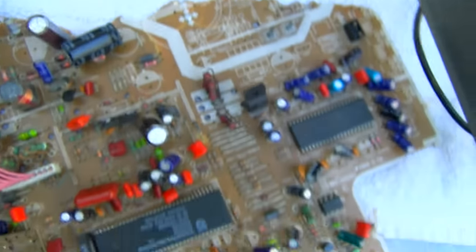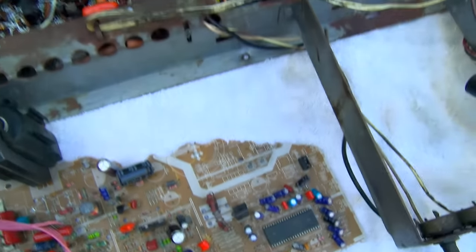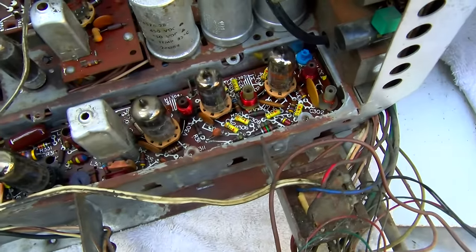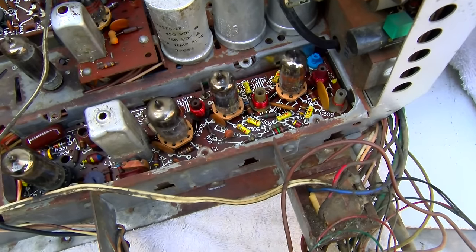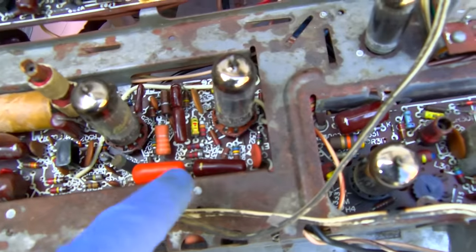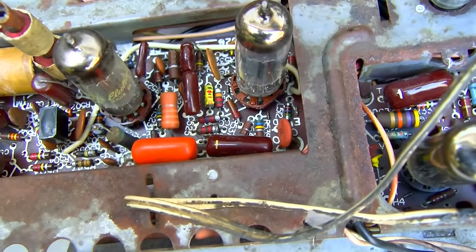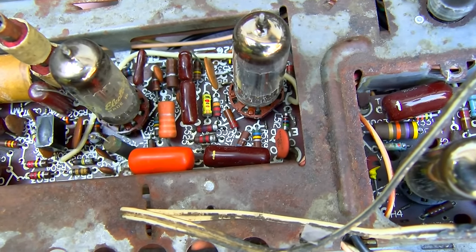There's our capacitor replaced - I just took a 222 off of a donor board. Beware of these tubular capacitors, these little yellow and blue things. I'm almost tempted to change that neighboring one too - I have no idea what it does, it looks like maybe a 1000pF.